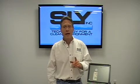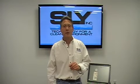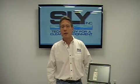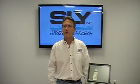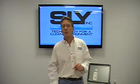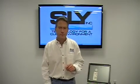If your collector was not supplied with an on-demand cleaning timer, you may want to contact us about acquiring a timer board which allows you to save compressed air and extend the life of your filter bags by pulse cleaning only when the pressure drop across your system reaches desired levels.